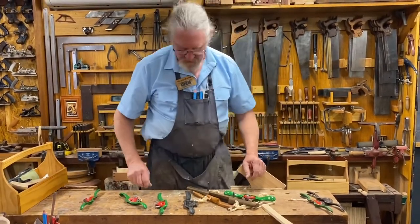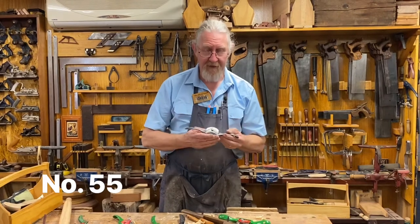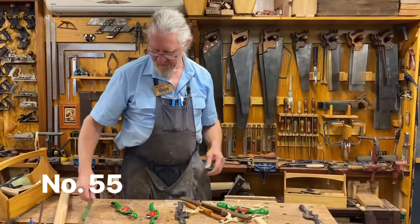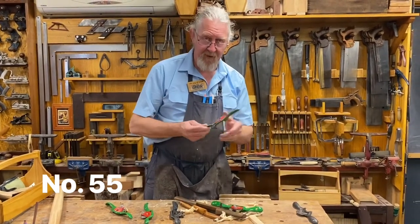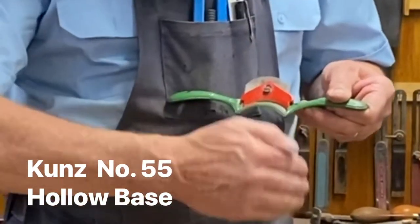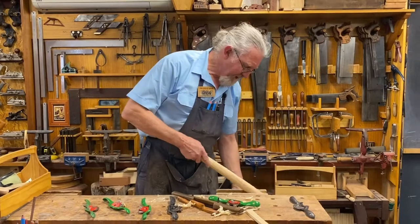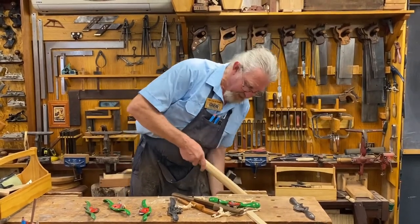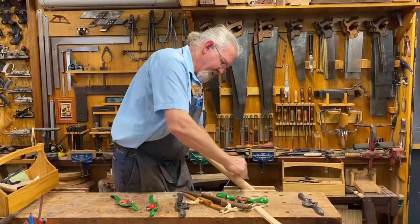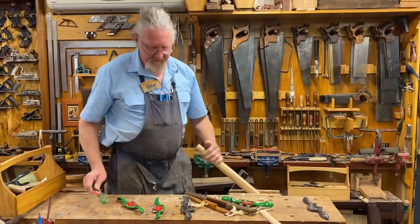But wait, there's more! This one here is the Stanley 55 — bit hard to find these odd ones. But Kunz of course have made one as well, and we have those available. I think I bought this one about 30 years ago. What's great about these is when you have a curved surface — we use these a lot when making spindles on legs. You might have roughed this out with a drawknife and then come in with this tool to do that really nice shaping. Because of the curve, it works really well for cleaning that up and removing the facets.